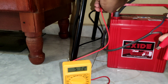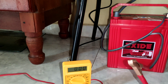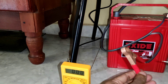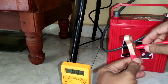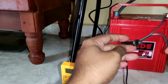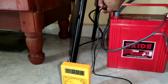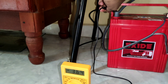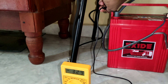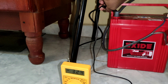Even at 5 amps, while I'm doing this I should be careful because I'm getting an electric shock — I don't know why but it's happening. Next test: I'm going to check if the battery is charging when connected to the power supply. If the multimeter shows minus, the current is flowing in the opposite direction, which confirms it is charging. Let's test that.